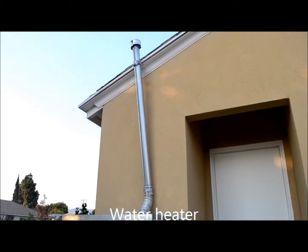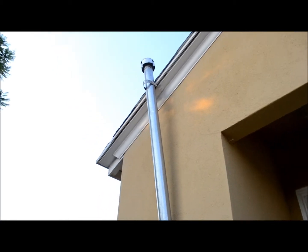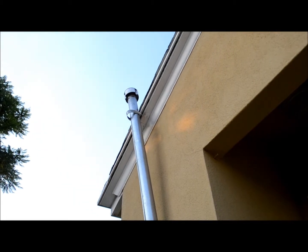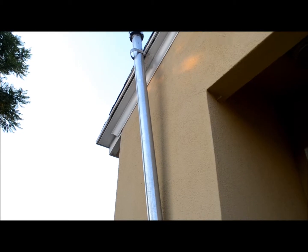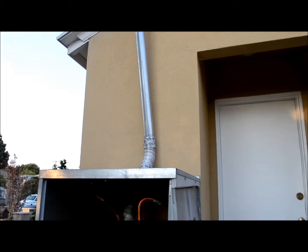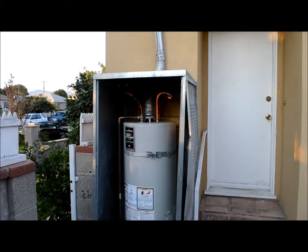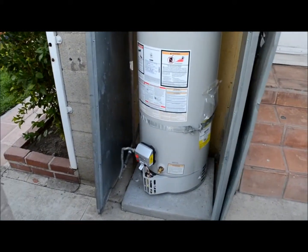So we're in the house at the Remington and they put a new water heater in. It has a loose strap on top and it's right against the wood trim. It's a single wall vent pipe, but the water heater installation manual requires a Type B dual wall metal pipe. You can see it's a newer water heater. The serial number starts with K, so that will be 2013.